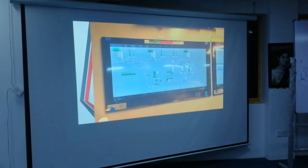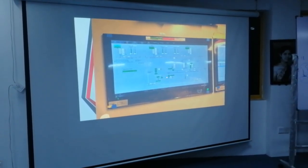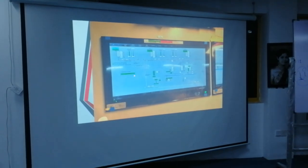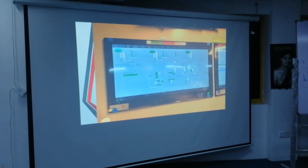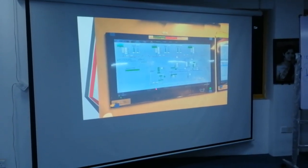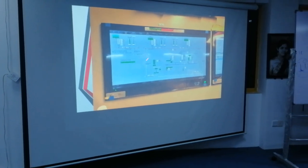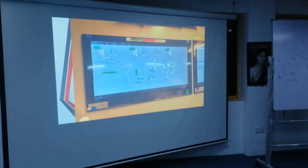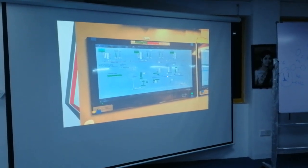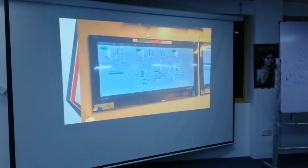This is the booster mode. Right? You need more power. This will act as a motor now to give more power to the propeller. And all this time the batteries are getting charged. So this arrow indicates now it's supplying to the DC bus, right? And also it's supplying to the hotel load through this active front. See?